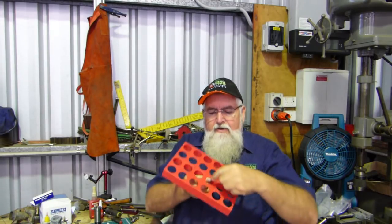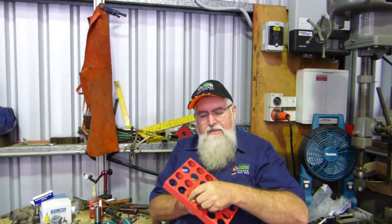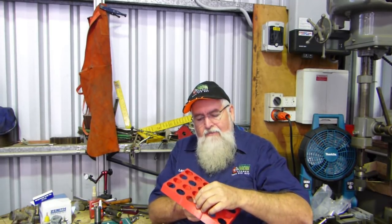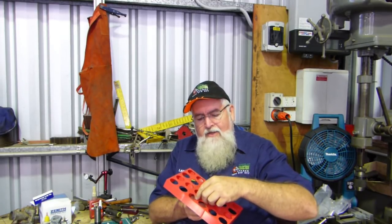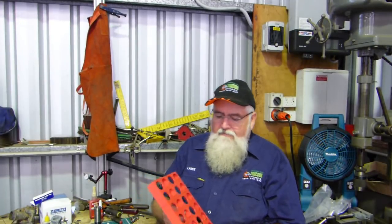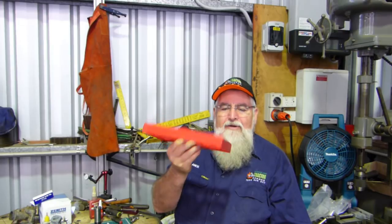The first ER32 collet holder I showed last week had curly edges, but I worked out what I was doing wrong — I had too much clearance between the nozzle and the bed. I brought that clearance right down low. What was happening was when I tried to do a circle, the plastic as it came around would pull out of shape on me. I worked out that if I dropped the nozzle a little bit and forced the plastic down onto the bed to make it stick, I haven't had a fail since I fine-tuned all that. So that's bloody good — I'm real pleased with the progress on the Fusion 360.